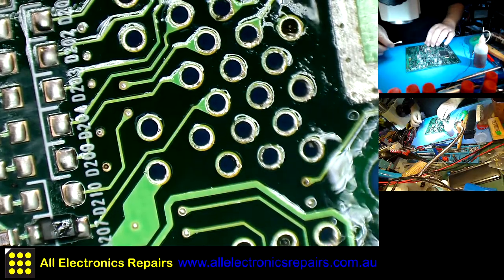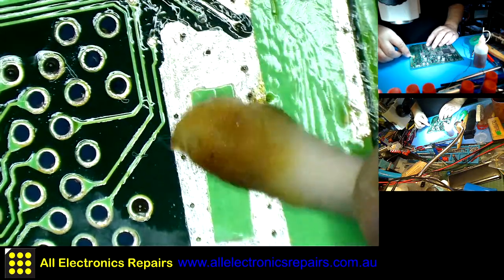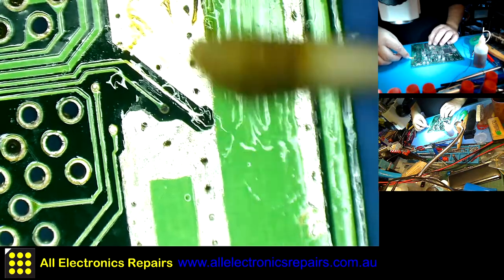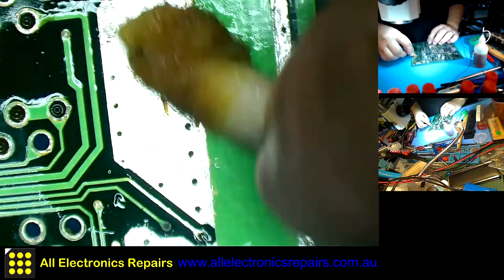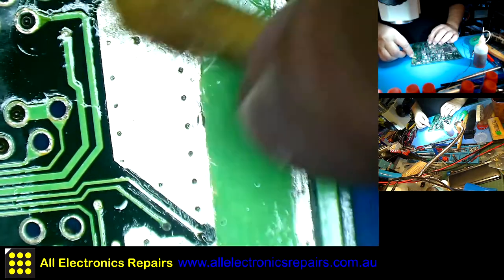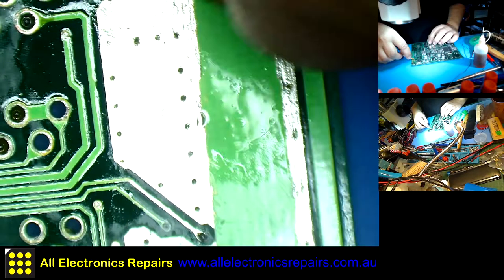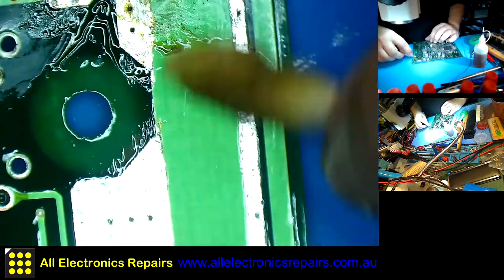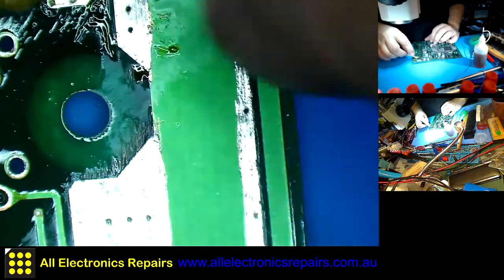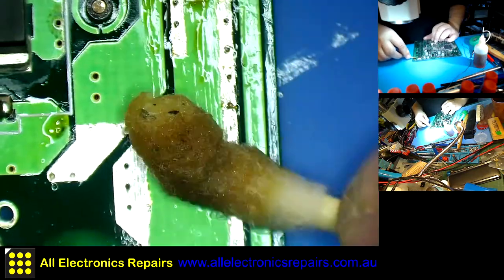However, flux being very sticky promotes collection of dust, and the dust in turn attracts moisture. So if the flux happens to crack just a bit somewhere in its surface, moisture can penetrate underneath and if enough oxygen is there, it could keep spreading even under the flux, and the flux would even keep on accelerating it then.